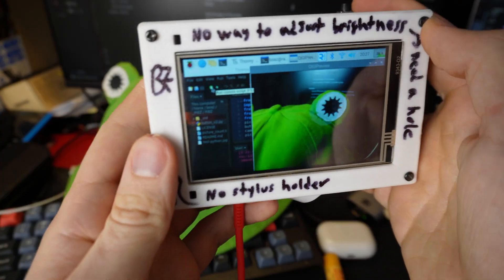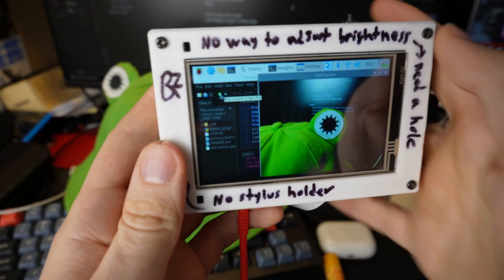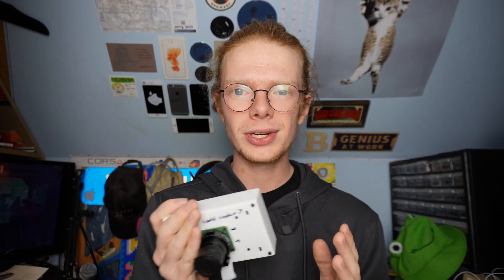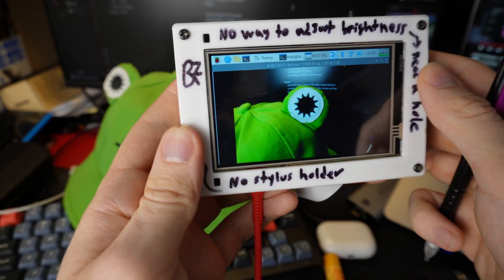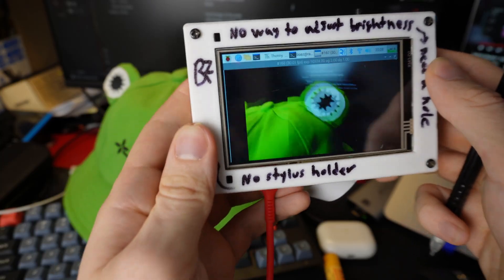There's a little bit of image lag when you're panning with the camera — it's kind of hard to describe but I'll show it on screen. I don't know exactly how to fix it. I've heard it has to do with memory buffers and RAM allocation. I've tried to max out those values on this 8GB model, but I can't go past five buffer frames in the current software without getting an out-of-memory error — which is weird, because the libcamera hello example runs very smoothly. That's for future me to figure out.